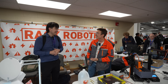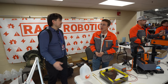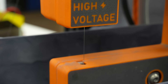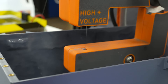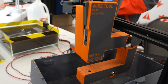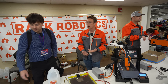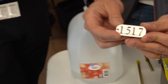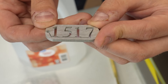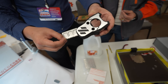Well, that's kind of a good safety mechanism, I guess. So what are you doing here? Because I heard this was a 3D printing convention. Okay, so that's not a 3D printer. Well, this is — or it used to be. What we're doing is we're bringing open source electrical discharge machining to the world of 3D printing. I've had a lot of frustration with 3D printing in the previous years with the inability to easily make complex metal parts, because not every single part can be made out of plastic. This is a three millimeter piece of aluminum, and we cut out this profile in about 20 to 25 minutes with wire EDM. You can't produce geometry like that with machining because of how small the tool head would need to be — we're using a wire that's 0.3 millimeters in diameter.